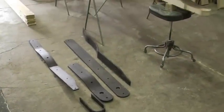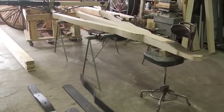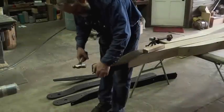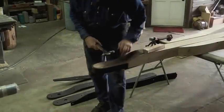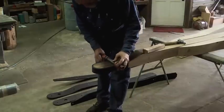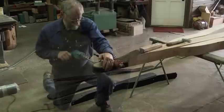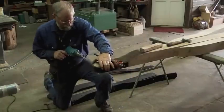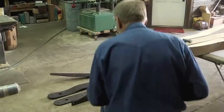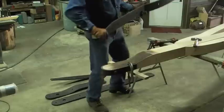This is a complete set of irons: the top and bottom plate, two side irons, and also the end cap that goes around the end of the reach. The end cap is half inch thick by two inches wide and gives strength to the king pin that will go through this end. We haven't drilled through the wood yet but will when all the iron is assembled. This is bolted to reinforce the stress on that reach end both in front and in the rear of where the king pin will be.